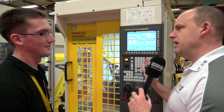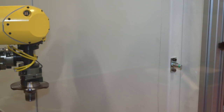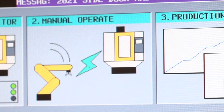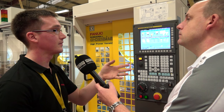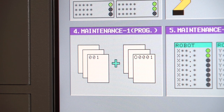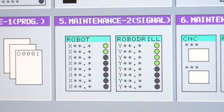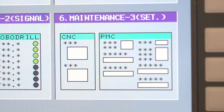Very quickly, talk us through items one to six. Item number one is system start — pretty much exactly what it says, it starts the system as a whole, so this drill if it was master would start itself, drill two, and the robot into a production environment. Manual operation gives you user manual control over things like the side door, and even allows you to jog the robot from the CNC. Production counter can be reset at the beginning of a shift, counting up to log how many parts were made. Number four, maintenance, basically maps CNC program numbers to robot program numbers. Five and six are maintenance screens for signals — you can see what signals are on in the drill compared to the robot — and number six also covers settings needed on initial setup.